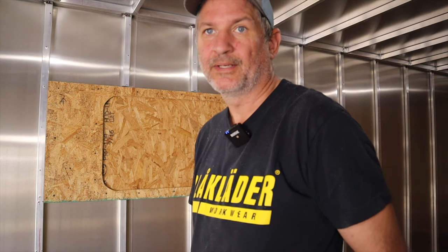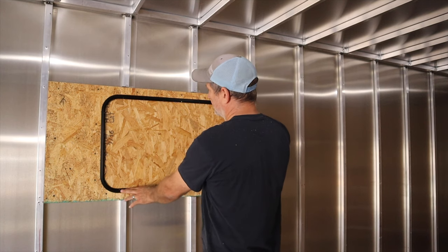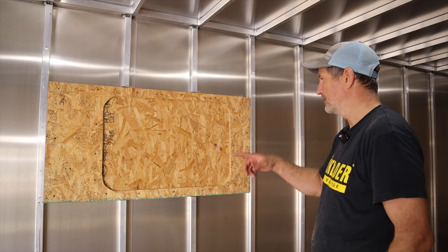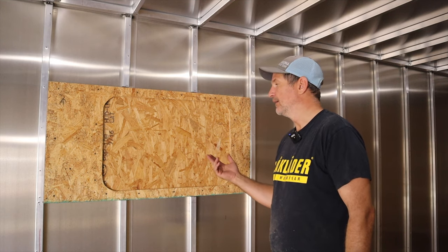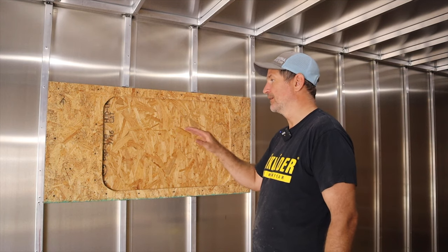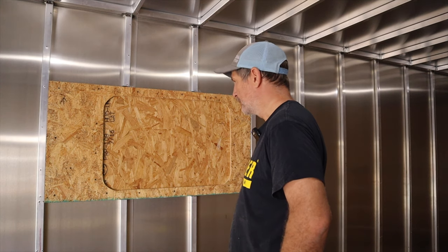You guys have missed a little bit but not too much. So I took this ring and used it as a template to make my template. I took the template on the first sheet of plywood to route out the hole, then I've glued this together. Once this is set up, maybe tomorrow, I'll route that out. At that point I can put this in and cut the outer hole. Once I've insulated and put the plywood back up, I can just take the router again from the inside and follow this - and I've got the perfect hole and can sandwich the window in. In theory, that's all going to work. Let's hope I'm theoretically correct.